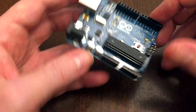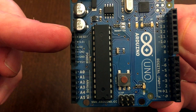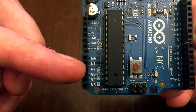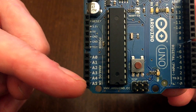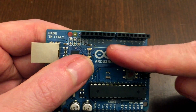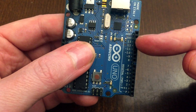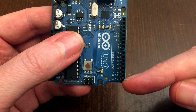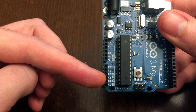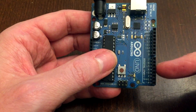So how this works — if I turn it around this way you can actually see there are a certain number of pins on the chip which are dedicated to power. There are then these A0, A1, A2 and so forth — these are for analog. And then on this side you can see we've got digital PWM. These are digital pins — they basically have a high or a low state, unlike the analog ones over here where you can have a low, medium, or high amount of power. These digital ones are either on or off.